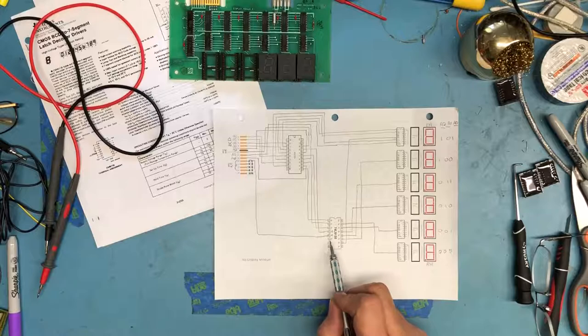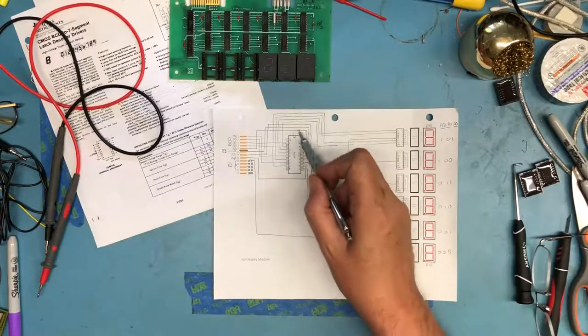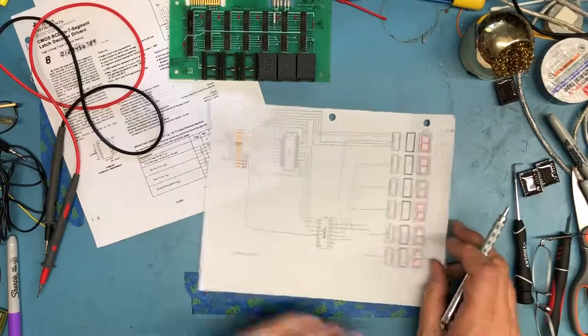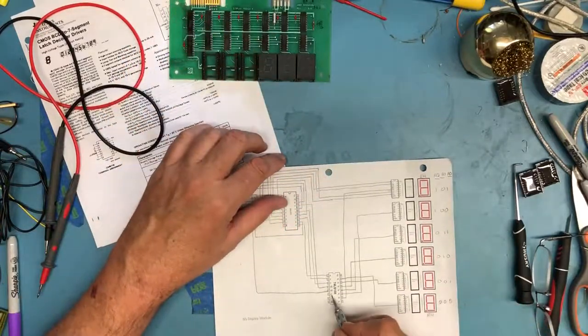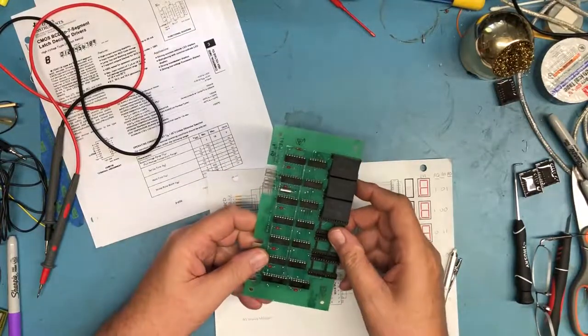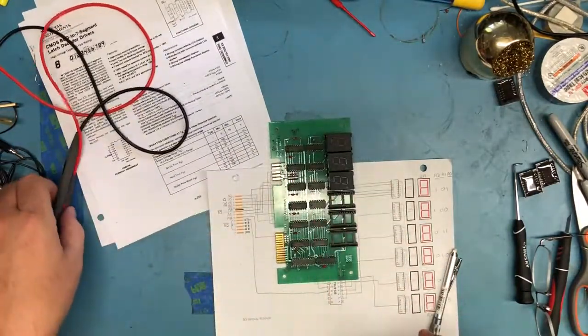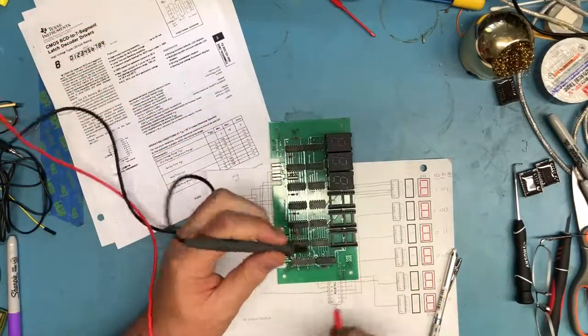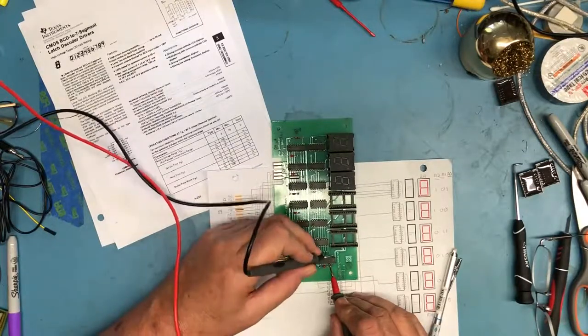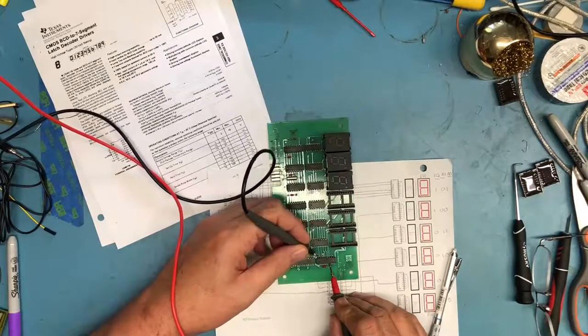I need to figure out what's happening with enable 3. I'm not sure what it would be. You know, we've consumed all the pins on the buffer. Enable 3 is an active high on pin 6. It may just be tied to VCC. Enable 3 is, as I just said, pin 6. It's not tied to VCC. Is it tied to anything?